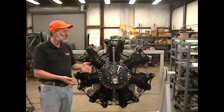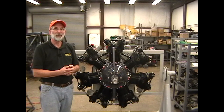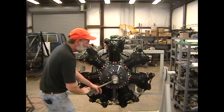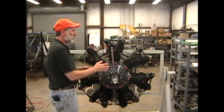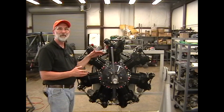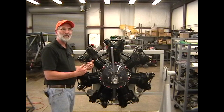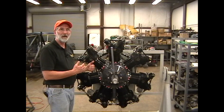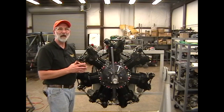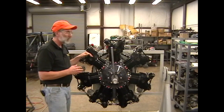That's why it's always very important to pull a radial engine through before you start it. People ask me, how many blades should I pull through? If you pull the crankshaft through two complete revolutions of the crankshaft, then you have gone through the four-cycle cycle of each of the cylinders — so you've done the minimum. You've pulled through to make sure that every cylinder is clear and that there's not a hydraulic lock anywhere. We talked about cylinders four and five being the main culprits. Earlier I mentioned that landing craft from Flags of Our Fathers that had the hydraulic lock.